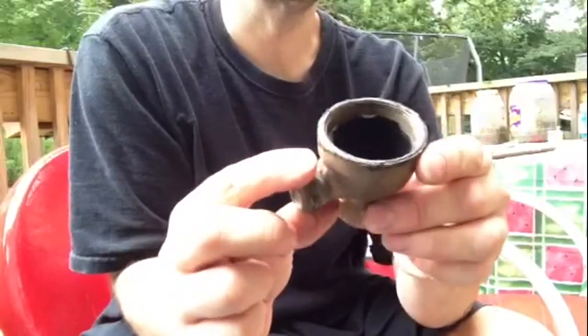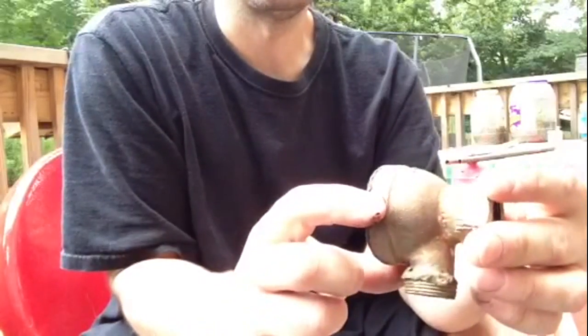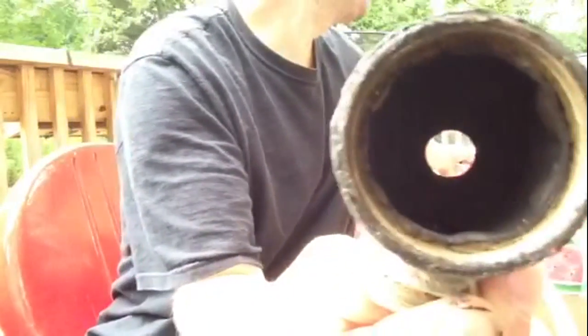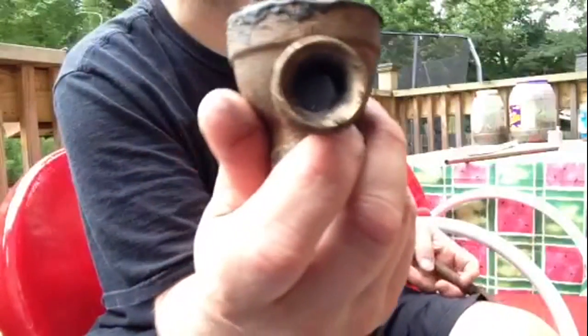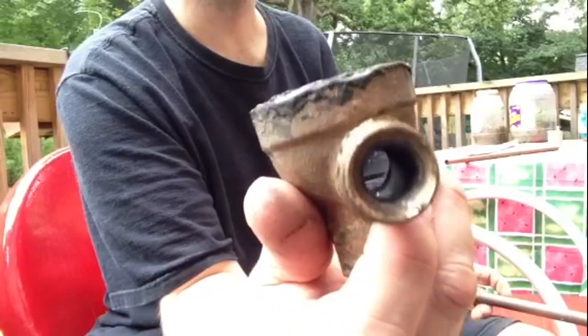You can take it apart, take the lid off — this goes on here. The problem when you do that — I don't know if you can see in there — is the hole inside of here is more like a 3/8" hole, and it doesn't flow enough water to have the system work. You can even see that hole there; that's not even half inch. Yeah, it might be — yep, that's a half inch hole there, but going into the side of it on the inside, it's nowhere near a half inch.